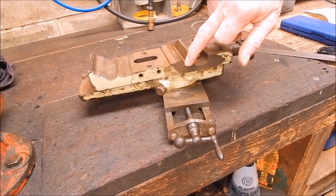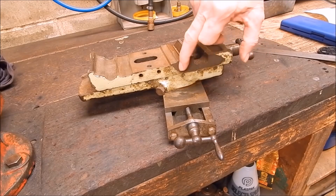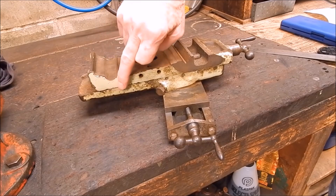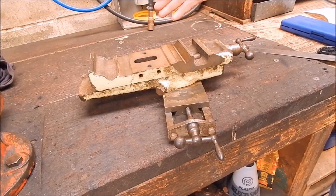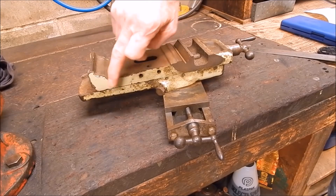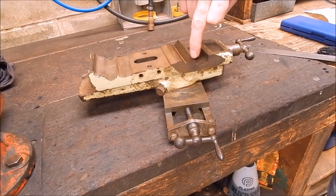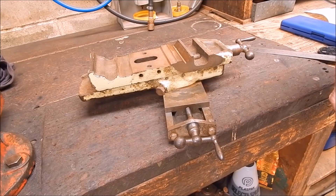It's interesting when you look at the way they've done this — they've ground through or cut it with a cut-off wheel and left it as a rough finish. Whereas back here where they've cut off the other wing on both sides, it's smooth, which sort of throws you. But when you run a finger along this, it's got waves in it. It hasn't been done on a machine — somebody's done it with an angle grinder with a sanding disc, and they've just smoothed it out. Then slopped a bit of paint on with a brush. It just shows you what people get up to.